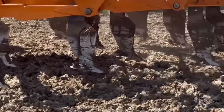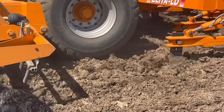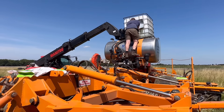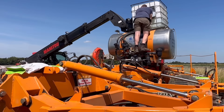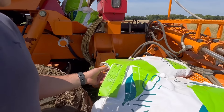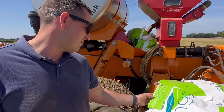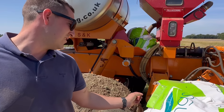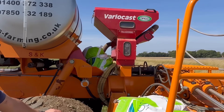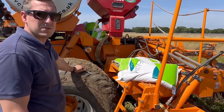You can see it's sticky because they've still got a lot of soil stuck to them. Just putting some more liquid nitrogen in the tank because we've run out. We're putting the equivalent of 80 kilos a hectare on, but that's just actually in the row — so in between the rows we're not getting anything at all. So Tom, what are you putting in? It's a bit of a blend: triticale, linseed, sorghum blend, rye, millet, quinoa, perennial rye, stubble turnips, fennel, phacelia, and some others. The seed rate is about 20 kilos a hectare. And calibration — seems to be working out. We've put two bags in, drilled a hectare, with a bit left in — so it's close enough.